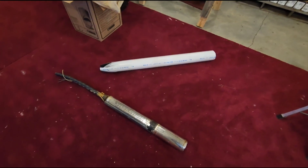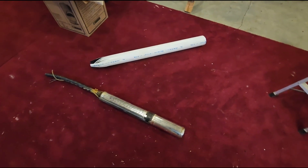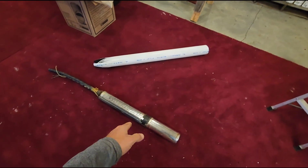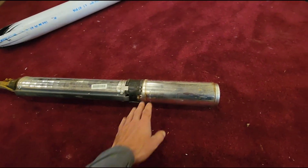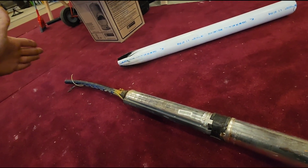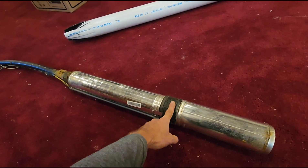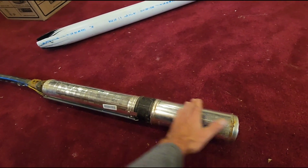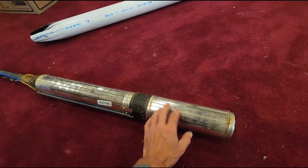The reason we had to pull his pump out was because we had to hydraulically fracture the well, as it would run dry — so it's not like this pump didn't see a really hard service life. What really kills a pump is heat. Even though your well pump is down in 50-degree water, when a pump runs and runs and runs, the motor gets really hot. The water is slowly coming down from the top, entering at the intake, and sending it back up to the house, so the water around the motor sits somewhat stagnant — and that water is supposed to keep the motor cool.